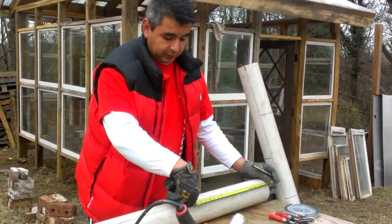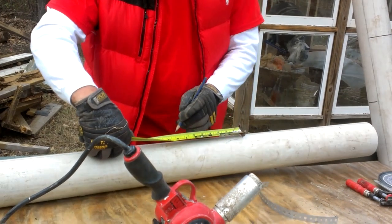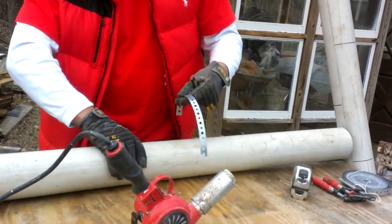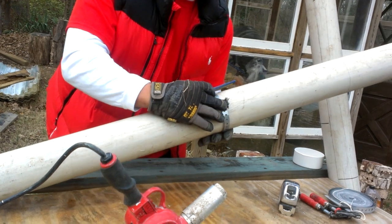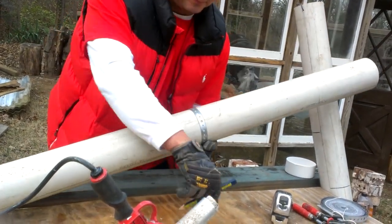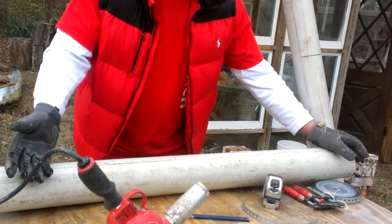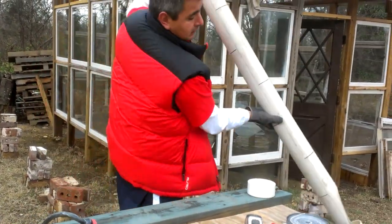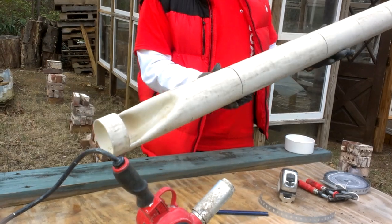Measure 10 inches over here, then 18 inches for the second line on the opposite side, then another 8 inches for the third line. You alternate sides — one line here, one line there — in a zigzag pattern. Continue marking every 8 inches all the way to the end of your pipe section, whatever size you choose. Then cut along those lines with a hacksaw or hand saw.